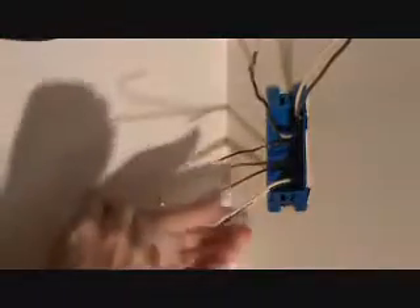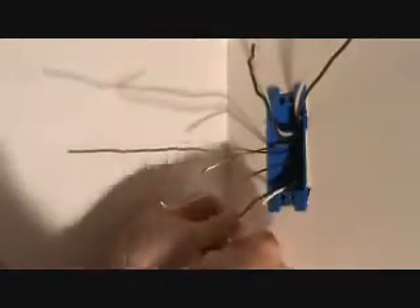I want to get these other wires up out of the way. I don't want the ground wires criss-crossing anything. I want the ground wires positioned so that once I get those connected, I can push all the ground wires into the back first. I just have to get the white and black wire out of the way — then I've got a straight shot to push those tight back up to the box.